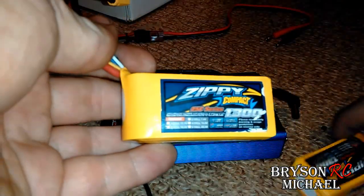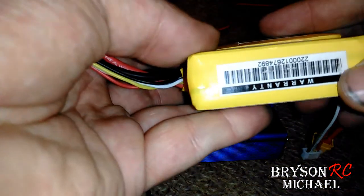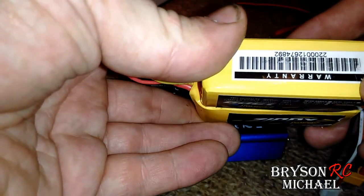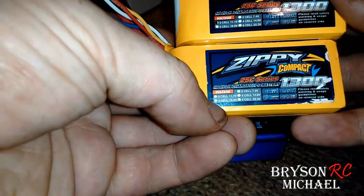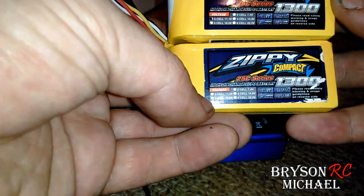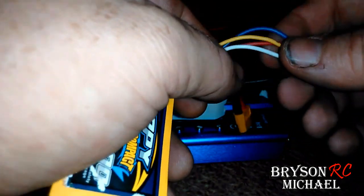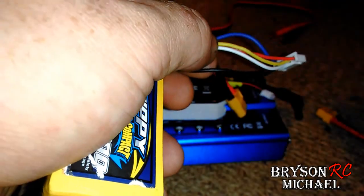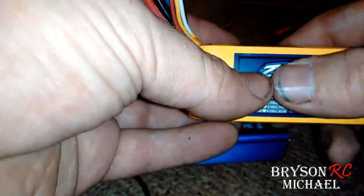You've got a 4-cell battery here. Not only is it bigger because it's got an extra cell, but they're actually pretty similar in size, so you may get thrown off. They both say 1300 on them, and this one has been rubbed off on the 4-cell so you can't really tell from the front. So what I would do is look at the balance port — there's the ground — and then count: one, two, three, four wires other than the ground. That's a 4-cell battery.